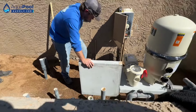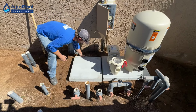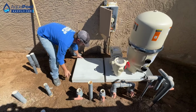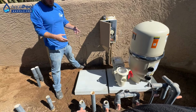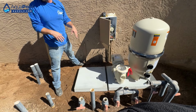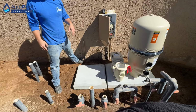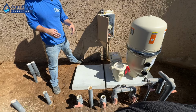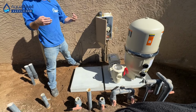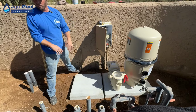And going back to those bolts and the pumps being bolted down, cement is super porous. Oh, yeah. So what was happening is the water, when you open the lid or do any work on the system, the water was going down and eating away at the rebar. So if you look at old pads, they all have an X, and that's where the crack is. And it's because that's where the rebar runs. So the rebar rusts out, loses its structural integrity, and then you get the crumble.